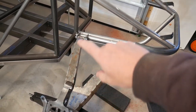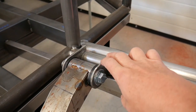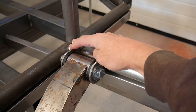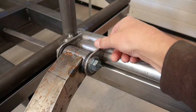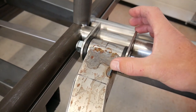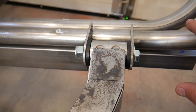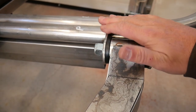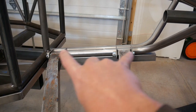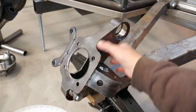I'm going to show you how I've got everything kind of set in place and I'll show you what the next steps are going to be. I've got the a-arm just kind of jacked up in place as to where it's going to connect onto the chassis, and I've got the spindle on there like it's going to go. I have not tacked these on yet — that's going to be the first thing I do. I've got these back as far as they can go and I can still get the nut in there. I want those two points as far apart as possible because the farther apart they are, the stronger the control arm's going to be.